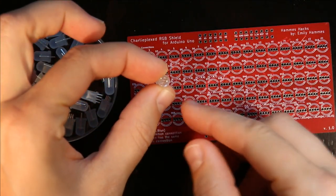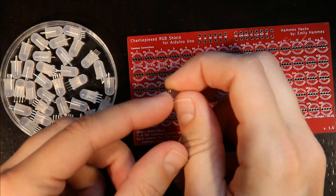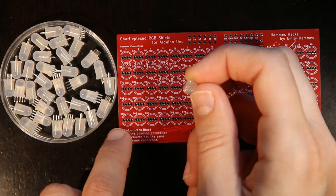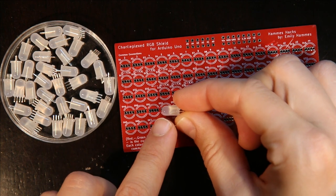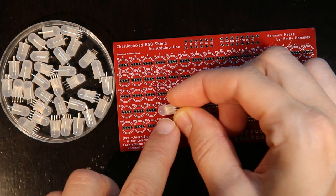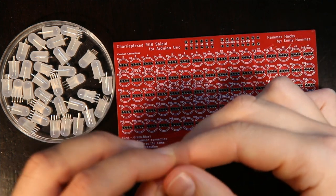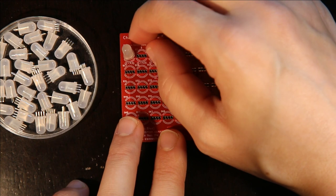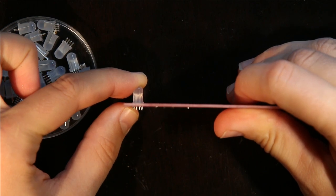And if you look at these LEDs, on one side, there's a flat part, and on these pins, there's a square pin, and all the other pins are round. Also, there's a slight flatness to the side that's the first pin. And if you look on the inside, it looks like there's a large Y part, and that large Y is actually the ground pin, and that's the second pin. So all of these should have the flat part facing this way. And the Y part like this. Okay?